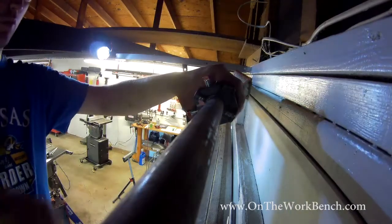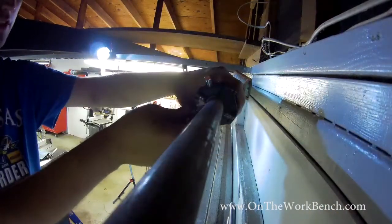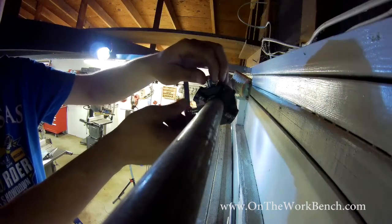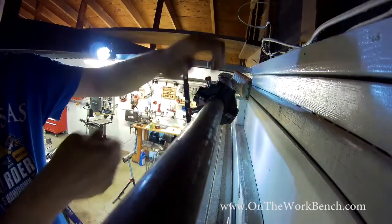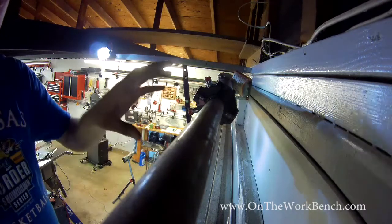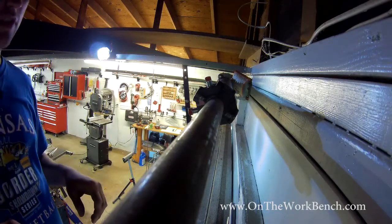And now as you get prepared to wind, I'm going to start on the right side here. And these bolts here that I loosened up before, I go ahead and just tighten them down just a little bit so that they come in contact with the torsion rod, then I'll back them off about a quarter turn, just so when I'm ready to tighten them up later, I will have an easier time getting those tightened with fewer twists and turns while the spring is in tension.